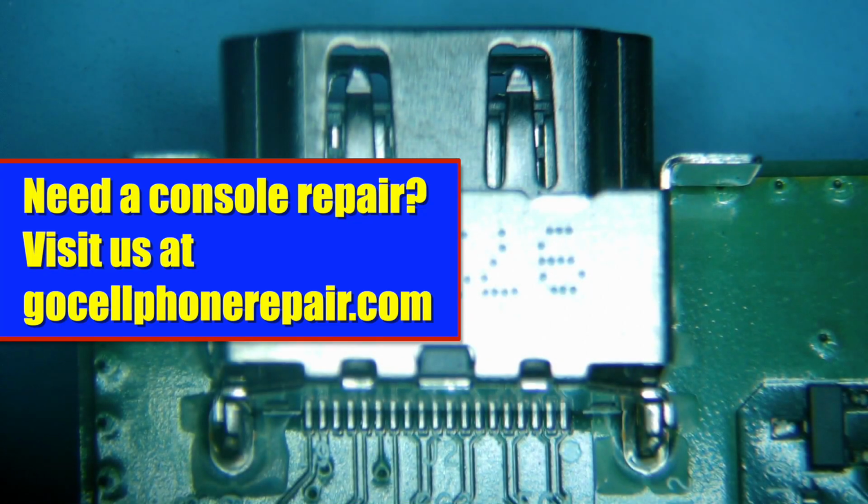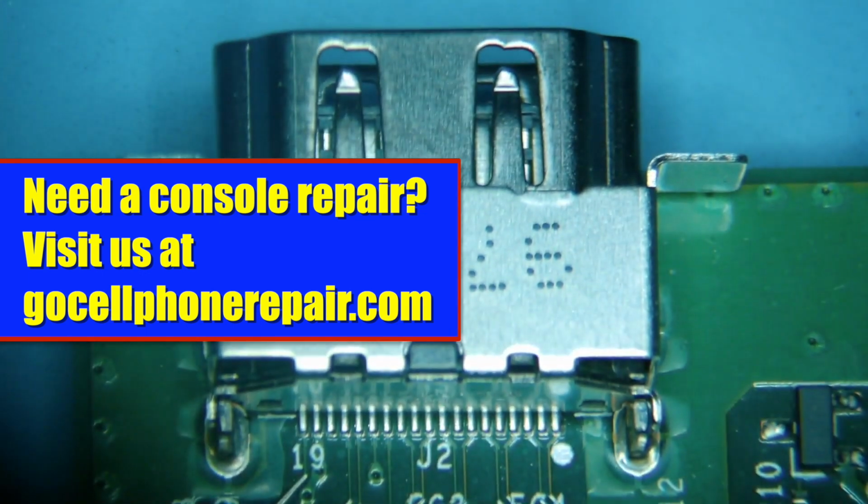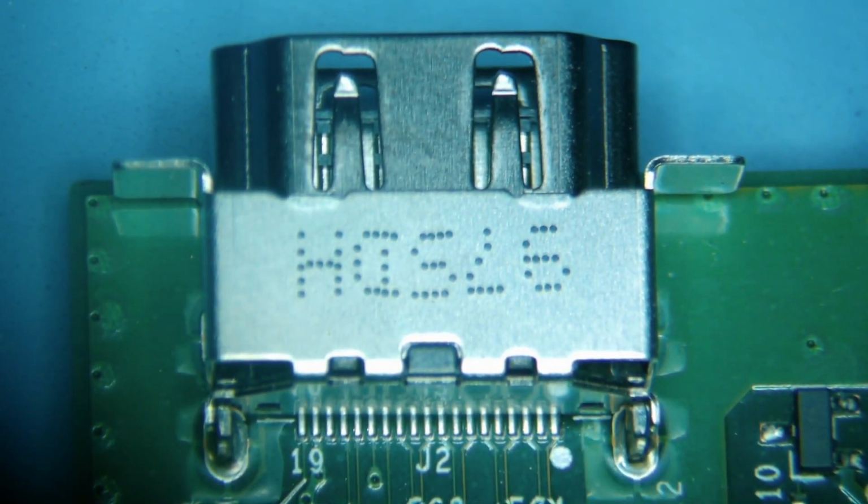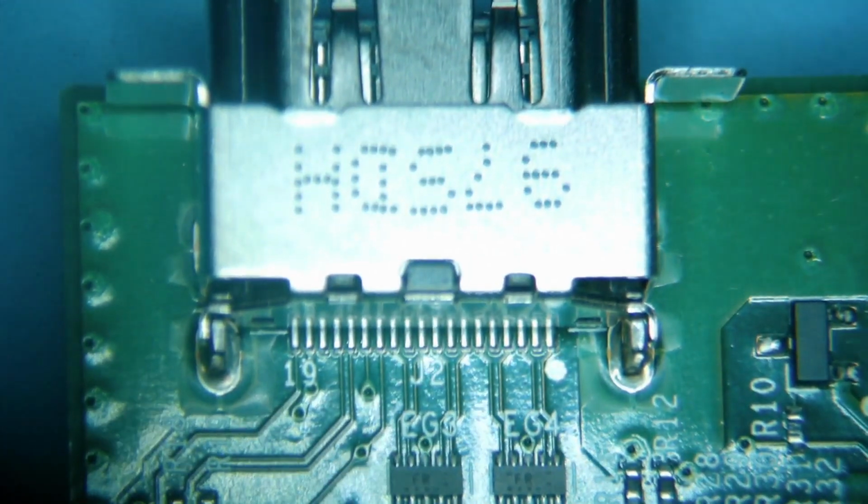This is an Xbox One X HDMI port. Physically, everything looks great. All of the lines are intact here. And if you check them in diode mode on your multimeter, they're all within specifications. So why do we not have an image?